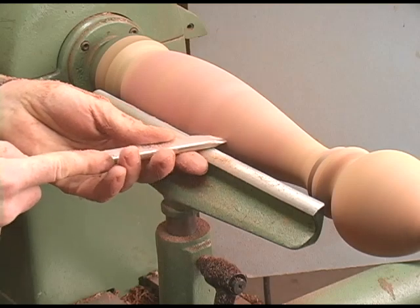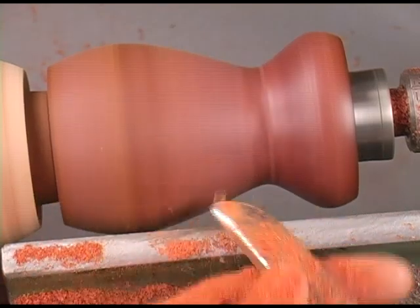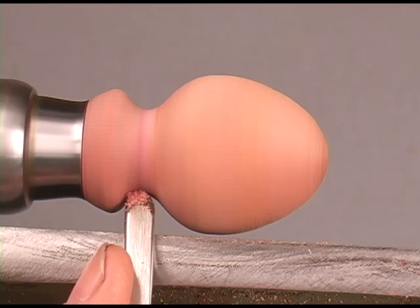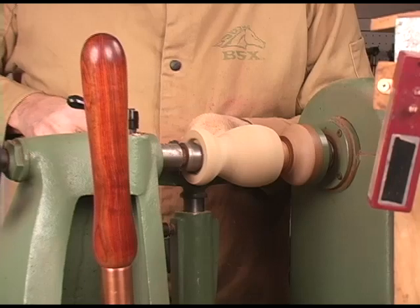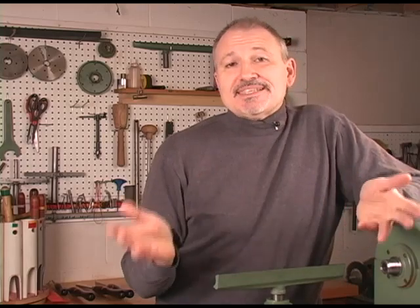I personally grind the cutting edge by hand and the chisels are ready for immediate use. The three quarter inch scraper excels on long broad flowing curves. The smaller half inch fingernail scraper is great for getting into tight coves and pulling out the form. I use these just before the sanding stage on all my pepper mills. The quarter inch is used primarily for smaller coves such as those found on wine stoppers. Some of the nicest pieces I have created and sold were very difficult to cut with a standard gouge. But with the finesse scraper I can relax and enjoy the shaping process, feel good about woodturning, not worry about catches, and concentrate on the creation rather than stress over the process. Good forms are really only a few wisps of wood away. I find using these scrapers the only sane way to finesse the form. They work so well I now use them on all of my pieces.